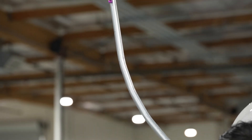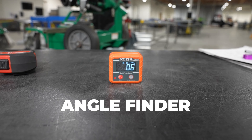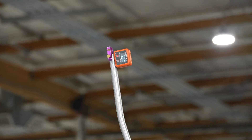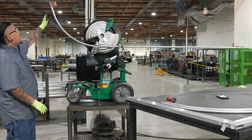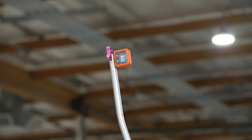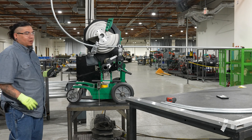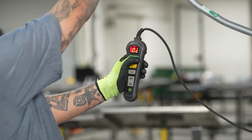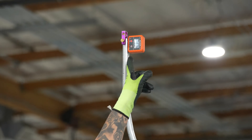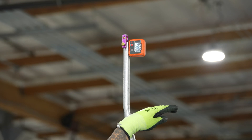For the very last bend I always like to get an angle finder — or you can use a protractor, either one will work. I place it at the very top of my pipe, above my very first line where it hasn't been bent yet. The reason I put it on right before the last bend is so I can control it going into that 90-degree zone. We're watching the angle finder — it passed right over 90, that's why it's facing the other way. I'm going to give it one more little push and loosen.